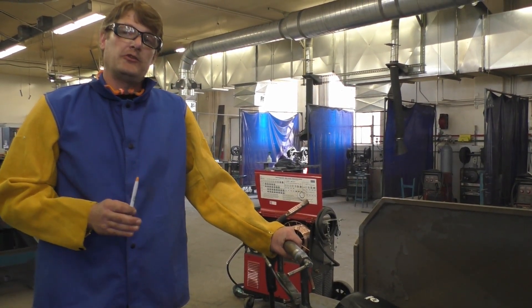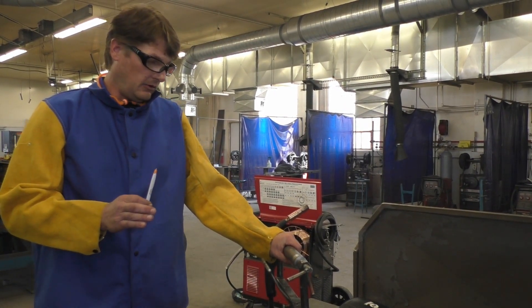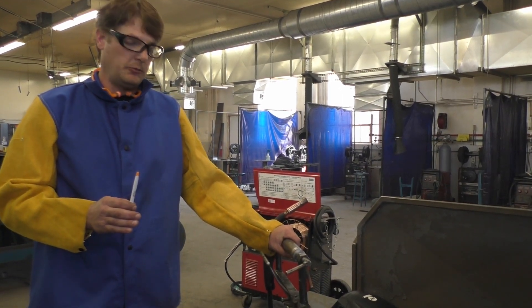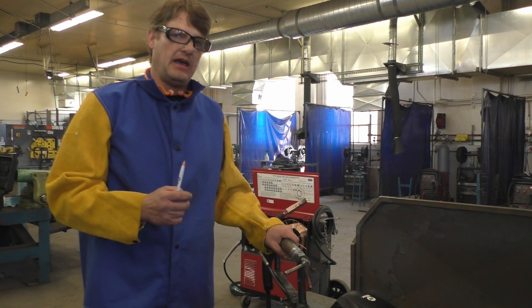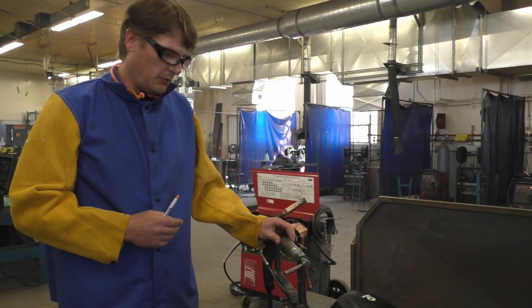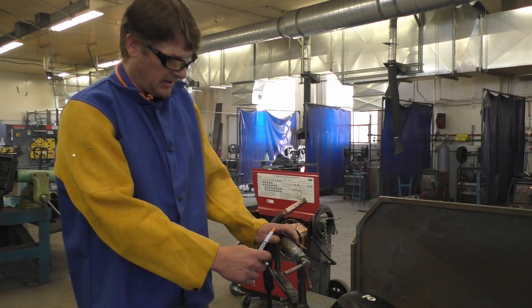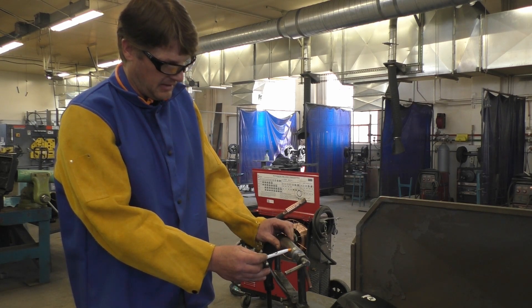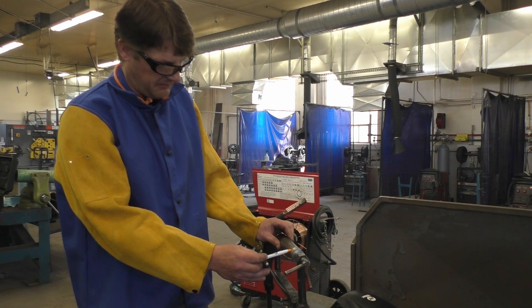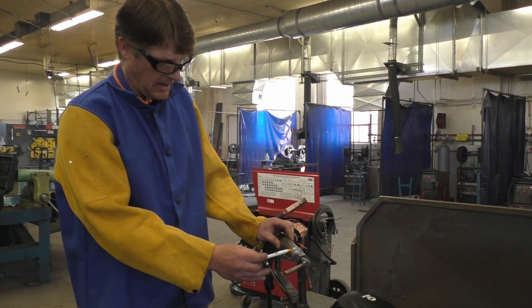It's really important to be comfortable. If you're sitting down and you're not comfortable, you're going to have a tough time doing this weld because everything has to remain fluid. You have to rotate the shaft in a counterclockwise direction as you're welding. Your welding gun will be set at a slight angle — probably five degrees towards your worn-out area.